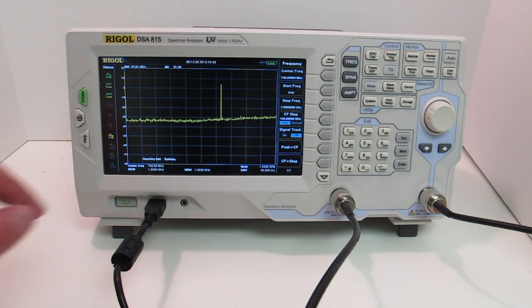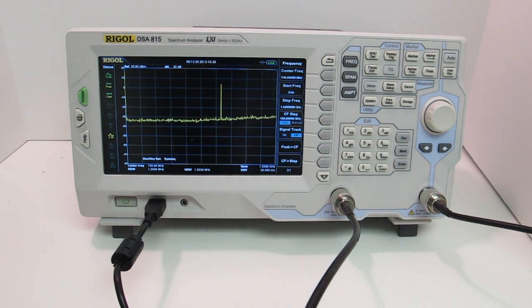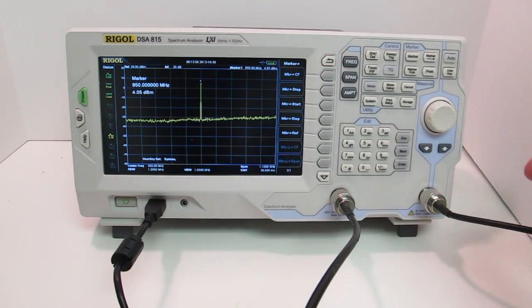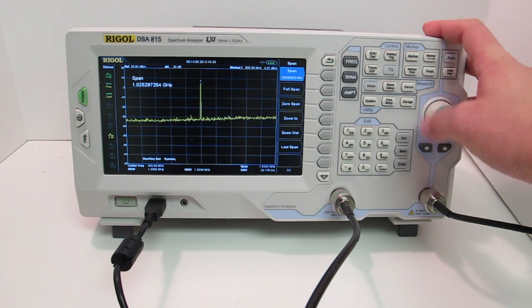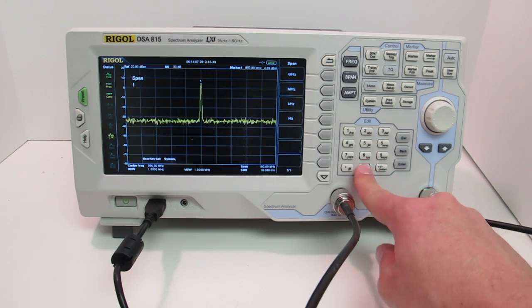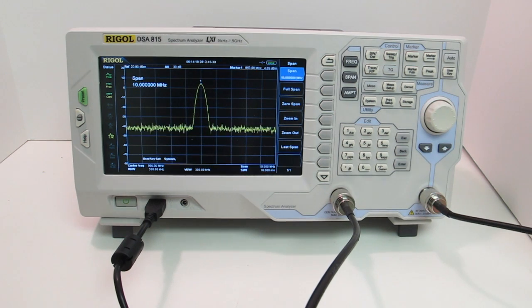On the left you'll see some status indicators that tell you what kind of detector you're using, what mode your traces are in, and other settings. To illustrate just how easy it is to get right to work with this analyzer, I have a 950 MHz signal set up that's being pushed into the analyzer. To measure it, the first thing I'd do is put a marker on it using just the peak button, then center the analyzer on it using marker-to-center-frequency, and then dial the span down — going right down to 10 MHz. And there's my signal.